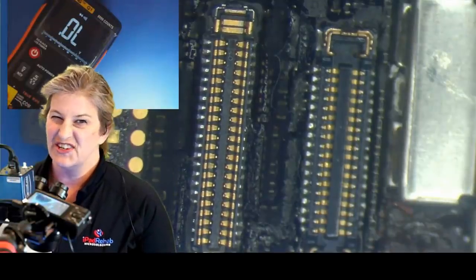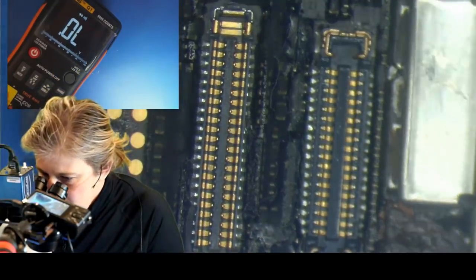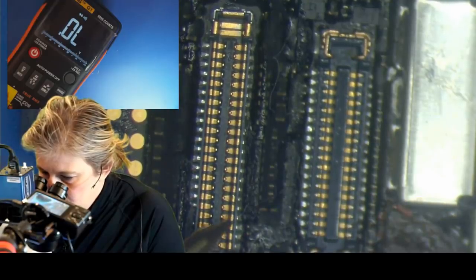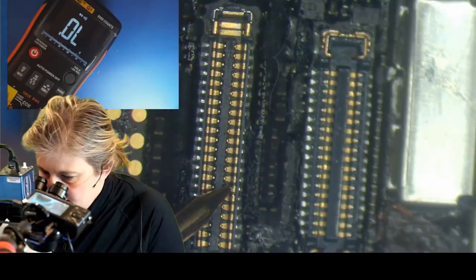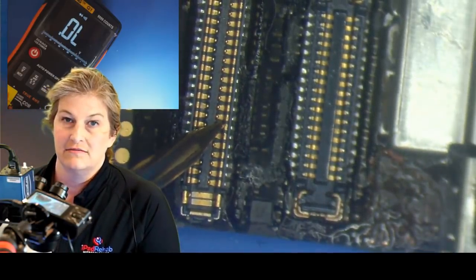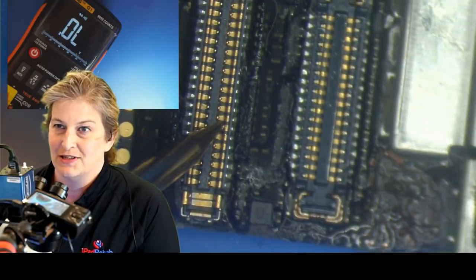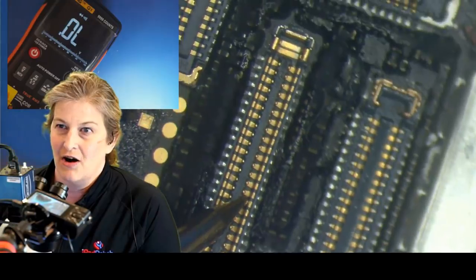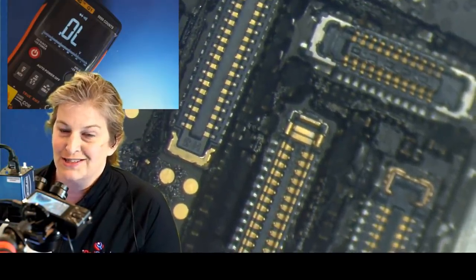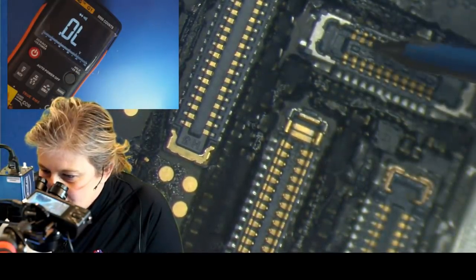All right, first, let's probe around a little bit. So let's check. Our open line here at pin 32 is in the 1, 2, 3, 4, 5, 6, 7 position. So this is definitely open to our actual nub that goes back to the CPU. But my question is, are these two spots connected? Is pin 7 or pin 32 connected over here to this third position? Let's see. Continuity test.